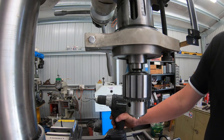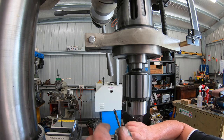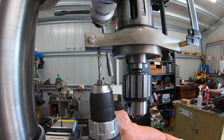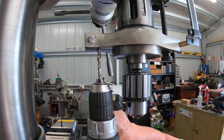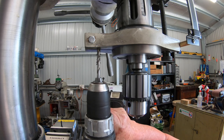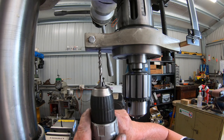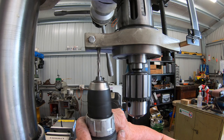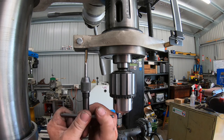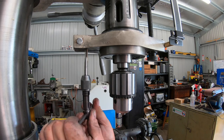Sharpen that drill first. Well, that was close. Went and sharpened that drill, had the fire back up into it, and then I thought, that's the wrong bloody drill. 6mm drill, not a 5mm. Could have been a problem, eh? Nice new sharp tap too, makes a big difference.